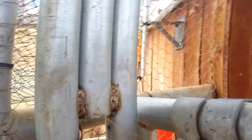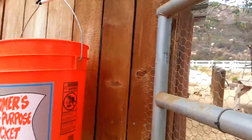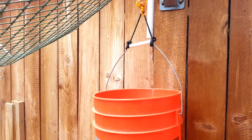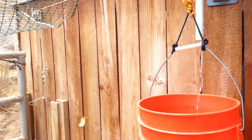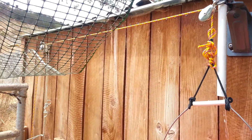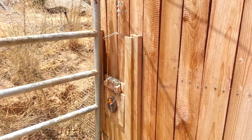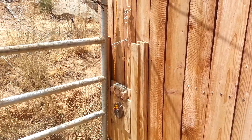I'm going to take you inside — take out chickens. This will fill up the bucket. So when this bucket gets full, it's going to use this rope and come down and overcome the counterweight on the slide gate and open the gate.